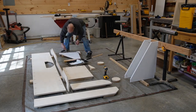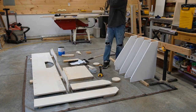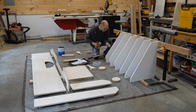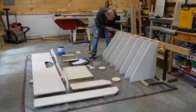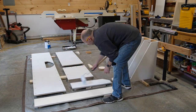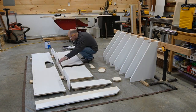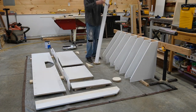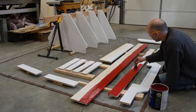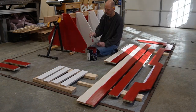Then I turned my attention to priming and painting all the visible surfaces. I laid a tarp down to protect the garage floor and placed scraps underneath each piece to raise them off the ground. I also set up a makeshift jig to paint both sides of the legs at once — when I finished painting one I'd screw it to a few boards clamped between roller stands so it could dry without taking up much floor space. I mostly used a roller to apply the primer but used a brush for areas it couldn't reach. When dry, I brushed on two coats of red paint to match the other painted pieces in the shop. I tend to prefer a brushed finish over a rolled finish for projects like this.